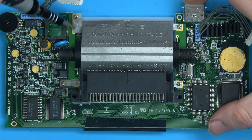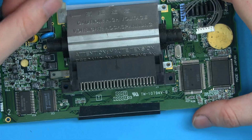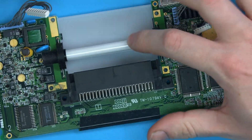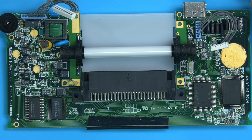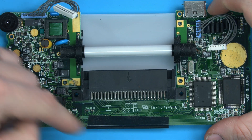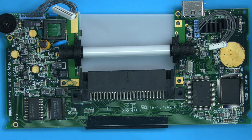The first thing we need to do is take out the four screws holding the screen in. Once you've done that, you can remove this bracket — lift up and over the backlight tube. To strip this down ready for a clean screen, I'm going to remove the tube, the inductor, all the caps, the LCD, and then recap the capacitors that are needed.